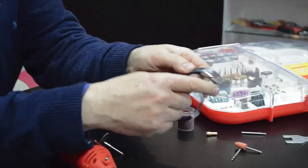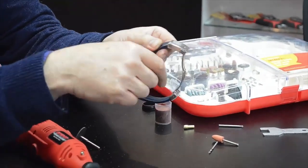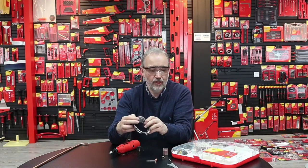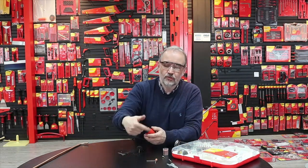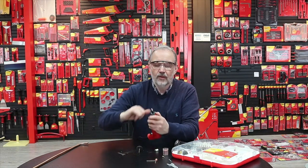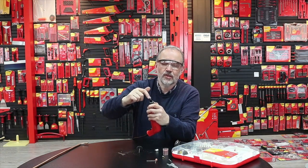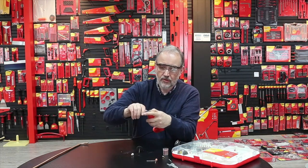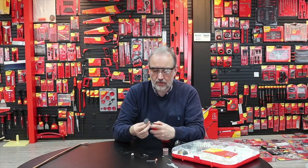And you can see there, in literally 10 or 20 seconds, I've put a high sheen on there from the polish. And the more time you take, any minor scratches on a watch case or a bracelet, you can get rid of them. So that's a very useful accessory. You get 4 different size felt burrs that go on the end here, and they just unscrew, and there's a piece here with what we call the pigtail thread. It's just got a threaded end on there, and you screw the felt polishing mops on the end. So that's another use.